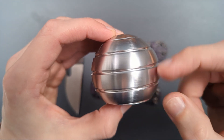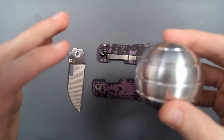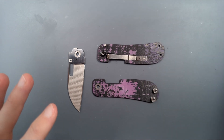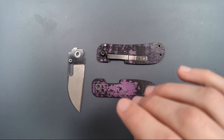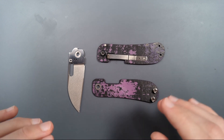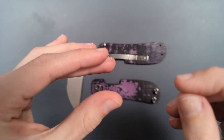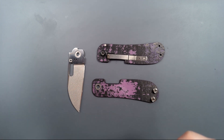The reality is you can only control this by moving the balls up or down or changing their positioning. Because the second one is lower down, you can only really make the detent weaker. I'll go further and say that on this particular knife, the second detent ball is not actually impacting the detent strength whatsoever. As far as I can tell, these holes are positioned directly above these balls and are the exact same size. I looked at this under my microscope — I actually have a microscope for this stuff now — at about 60x magnification, and it appears exactly centered above and never actually making contact.